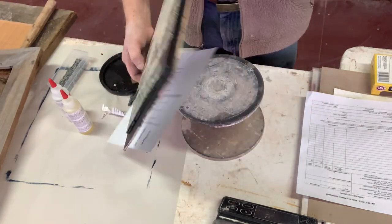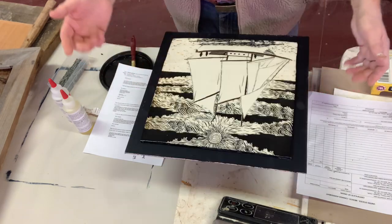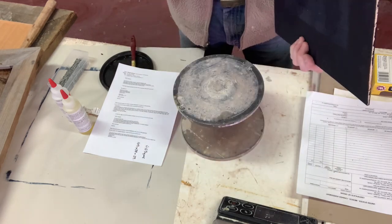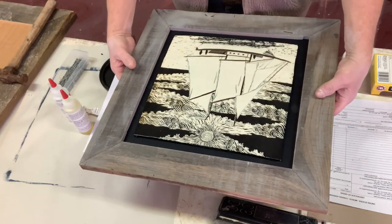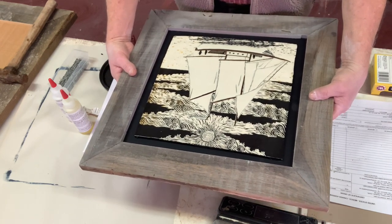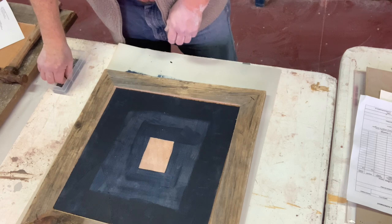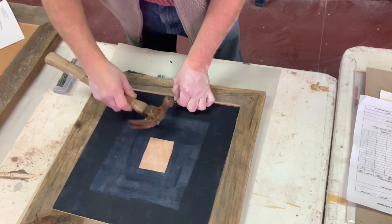The tile has been glued down and sitting for a couple of days. There's the back that I left open. I usually sign on the piece of board — I can do that after it's in the frame. I also sign on the back, so you've got two ways of doing it. It's very easy — just make sure you cut your wood the right size. If your frame is a little loose, which I prefer, place it over and turn it over so it doesn't move, then put it back. Make sure it's level on the inside and then use pin nails — very thin finishing nails.